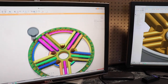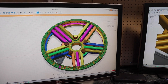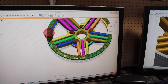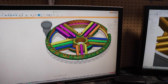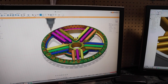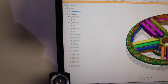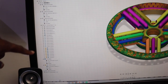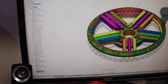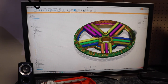Now it's just pre-drilling the holes for the assembly bolts and then opening them all up. Can't wait to see how these come out. This one wheel — all the tool paths over on this side — all the tool paths required just to make that. This whole list right here, that's all the different commands. Probably almost 20. Every feature needs its own path to make sure it gets cut.